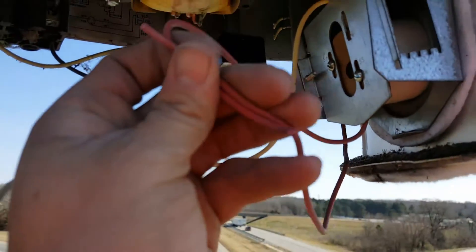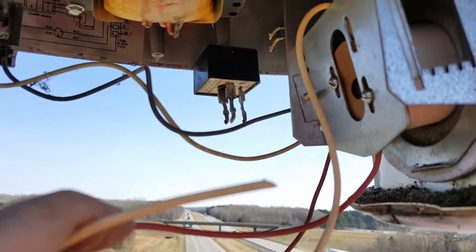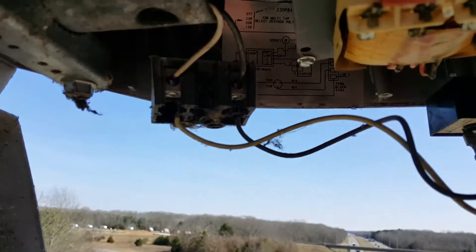You've got your wires up here from your photo cell — you've got a black, a white, and a red. Your black is already connected, so you just leave that connected. Your white is also connected. Then you have your red wire — you're going to take your red wire that was going to the transformer and then it goes from the light socket itself; you're just going to connect those together. You're going to take your other white wire from the light socket and attach it to these right here, and that'll be it.